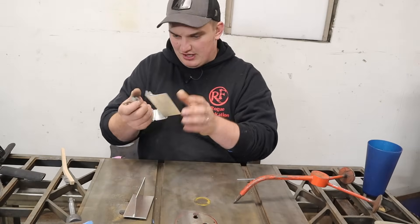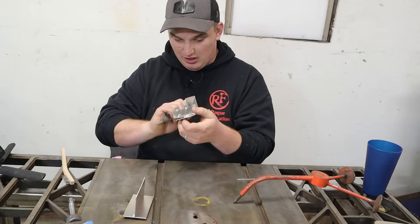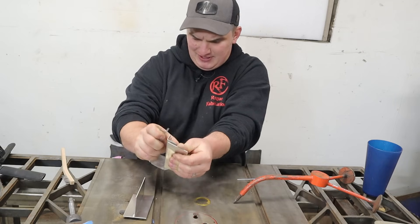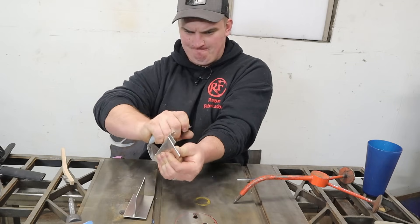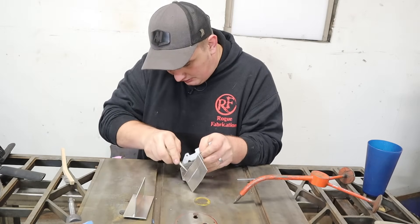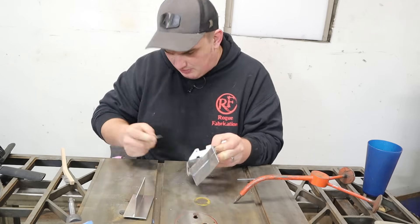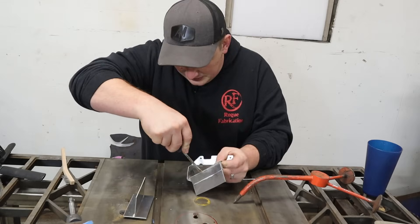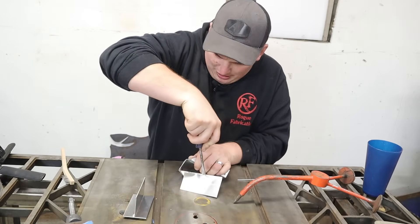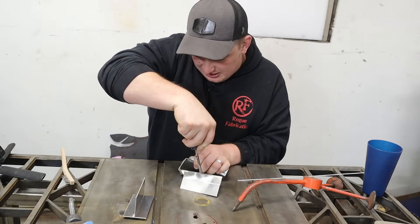We have this cooled down pretty much now — this is our galvanized truss hanger joined to our aluminum — and let's tear on it a little bit, see if we can delaminate it. I'm going to take my awl here. This is only sixteenth-inch aluminum plate to sixteenth-inch galvanized steel, but — there you go, it finally just delaminated.